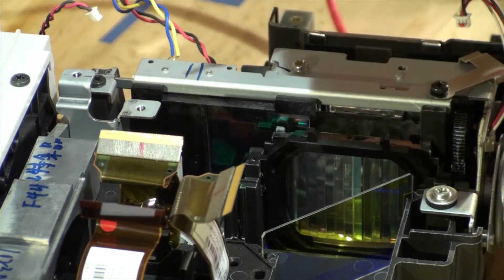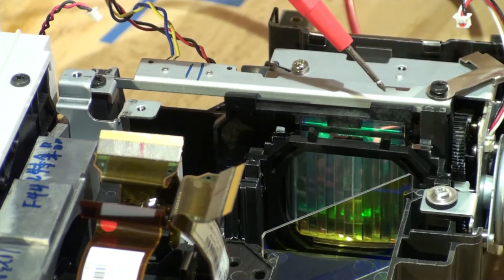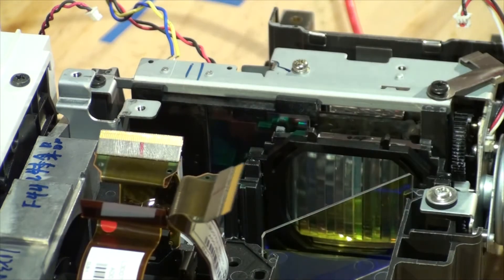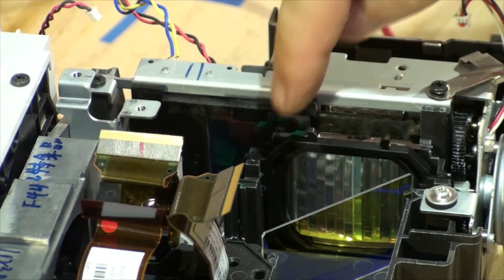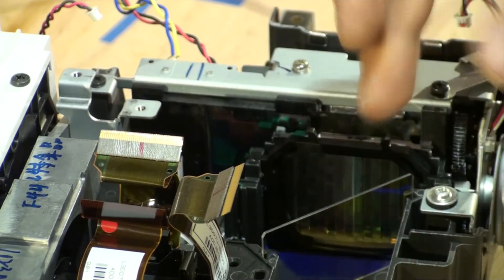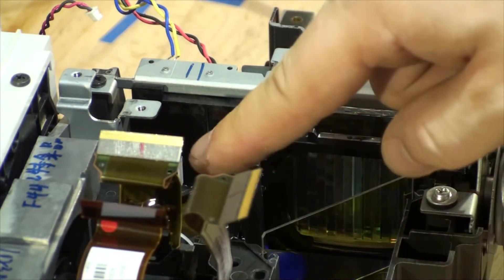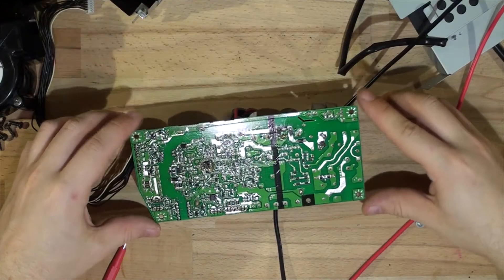If I connect power to the motor you'll see the filter slide — it just slides in and then filters for the XV Color. Those two wires are just a switch to tell the computer which position it's in. After that the light goes through a lens, then through filters and splits three ways for red, green, and blue, entering from three ways onto the LCDs themselves — literally black and white LCDs. After that it combines in the prism and shoots out of the lens.